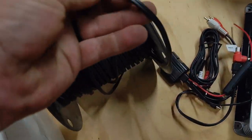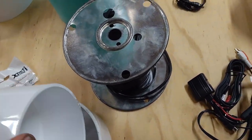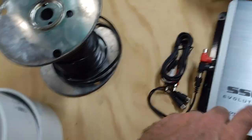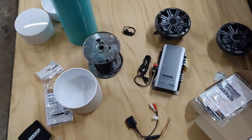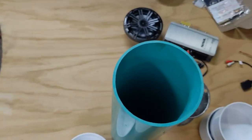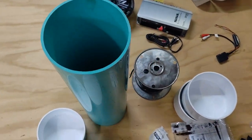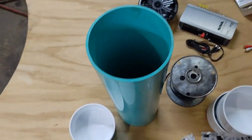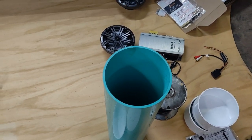For wire, I just use lamp cord because you get a spool of it fairly cheap. The two things I'm missing: a 12-volt accessory plug to power the amp, and a two-by-six board. If you take and bevel the edges of the two-by-six, it will fit inside the pipe and the amp will sit on top of it. This keeps the amp up off the bottom in case you poke a hole in a speaker and water gets in.